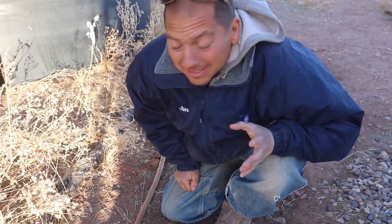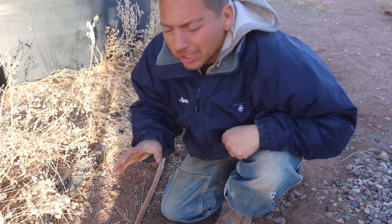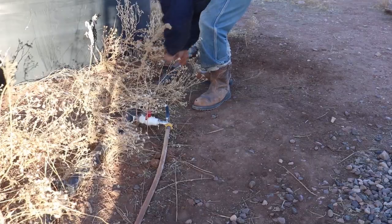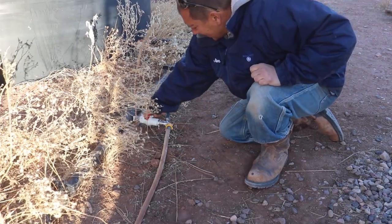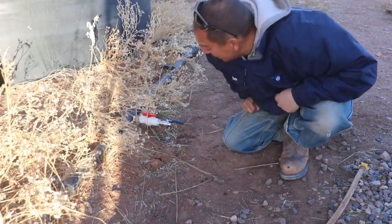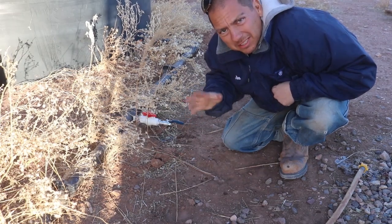With these crazy winds, it's also going to bring some cold temperatures tonight — it's going to get below freezing. Anytime it kind of dips below 30, I like to clear out this pipe here, so I just close off these valves and then drain everything out. Figure it's better safe than sorry and just clear all this out so we don't get any trouble. I got it insulated and wrapped but I'd rather be just a little bit extra cautious.